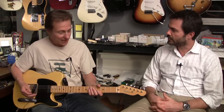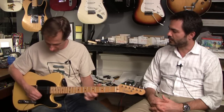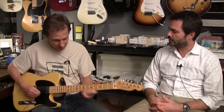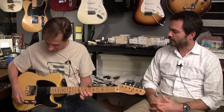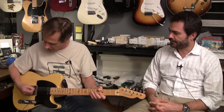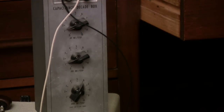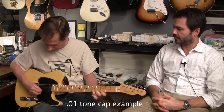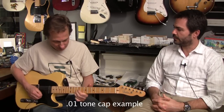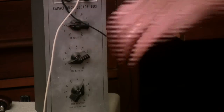You really get a usable tone; even if the tone knob's turned all the way off, you still have enough clarity that it's usable. This is pretty much only good for bridge pickups, because this same value on a neck is just too subtle — it just doesn't do the neck pickup very much good, it's almost the same tone. So in the neck position, you might want to get back to an 0.01 or 0.02. These are also popular Fender values.